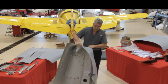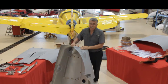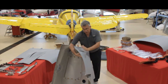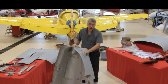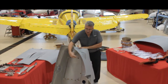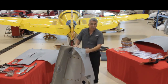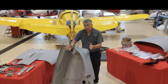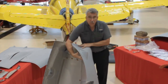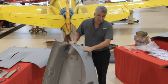This particular airplane — this customer opted to put our boom beam landing light in place. That's been pretty popular in the last decade or so. Some of the older models had a bucket on the inside where you put your landing light with a clear lens. This is actually a better fit-up. We pull it a little bit farther forward because the boom beam landing light is a little bit deeper, and there's a muffler and shroud right behind there. Not a whole lot of room, but by pulling it forward the light works a little better and you get a wider angle of view on the beam. Plus, this can stay in place when you take the cowling on and off — the old-style bucket had to be removed every time you pulled this side of the cowling off. Much better improvement.